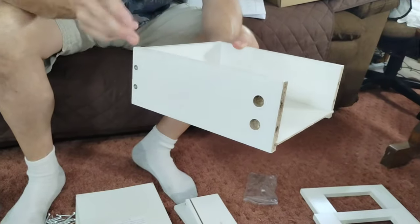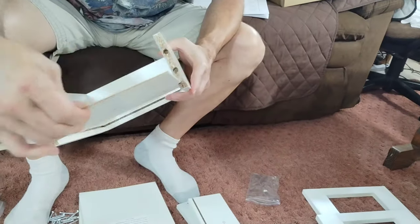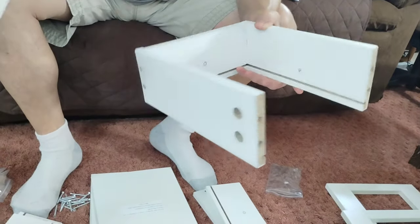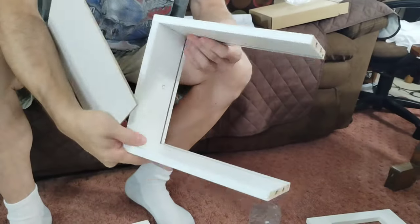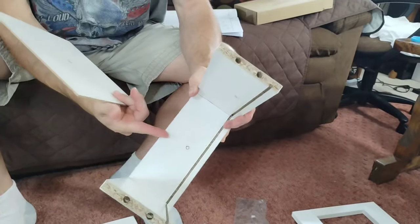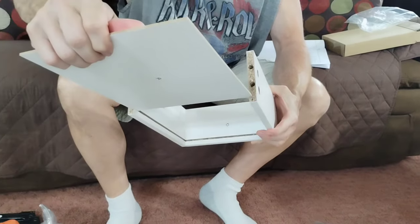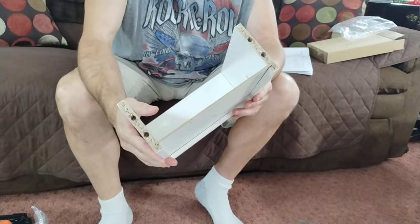The O's are on the outside — the O is on one outside, P is on the other outside. You want your lines on the inside. You're going to put two screws, number fives. You want to run the O and the P into the Q. Then you're going to take your R, which is your drawer bottom, and you're just going to slide it in there. You're going to do that to all four.